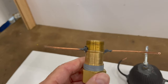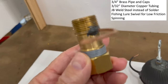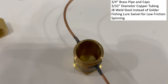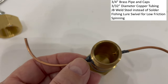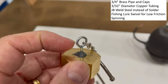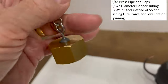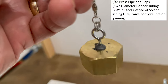I got a three-quarter inch, about two-inch long brass pipe nipple with a brass cap on it. I drilled a couple of small holes — about 3/32nds — for a small diameter tubing I had on hand, and I bent it into a curve. I used JB Weld steel to glue them in rather than solder, and somewhere in there I've got a screw eye held in with JB Weld steel.